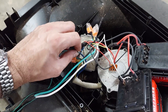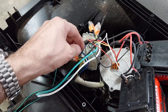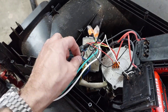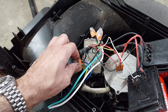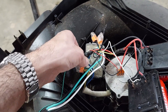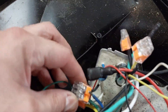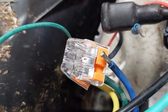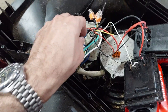You can solder these wires together, but that's a bad idea. A better idea would be to get some XT60 connectors, solder the wires to the XT60s, and then connect them — those are actually meant to take that kind of voltage. What I think happens is they partly wiggle out, and when they wiggle out there's arcing, and when there's arcing the plastic melts, and then it doesn't connect properly.